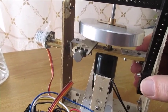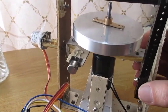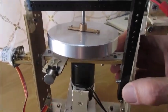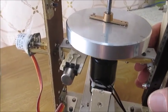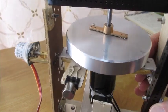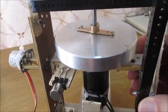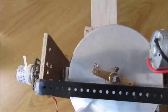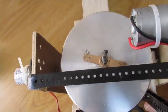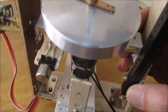So you need active control of some kind to control the precession of the gyroscope. Precession is the little movement that a gyroscope or a top makes when it's spinning — a little circle that it describes. The tip of the axle describes a little circle, and you need to control that somehow.